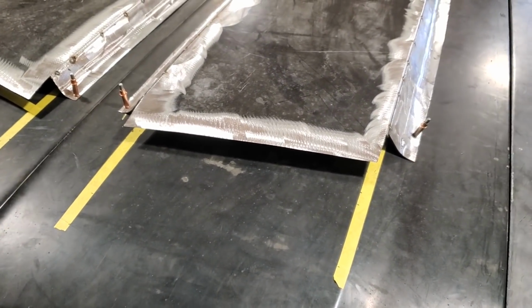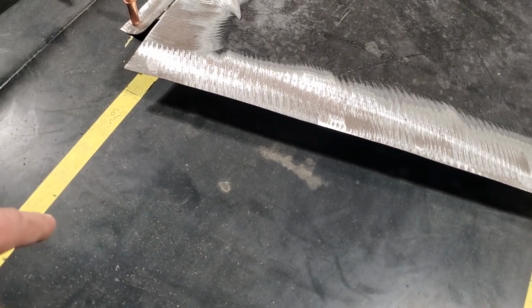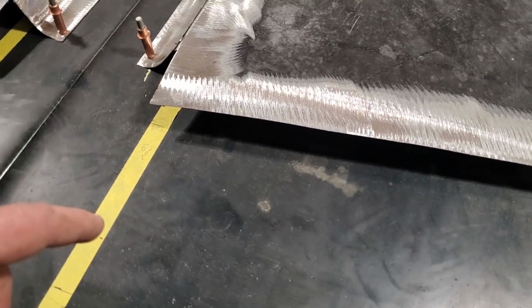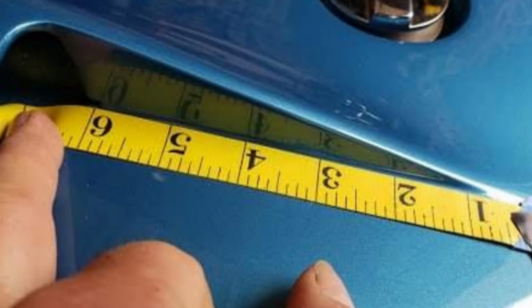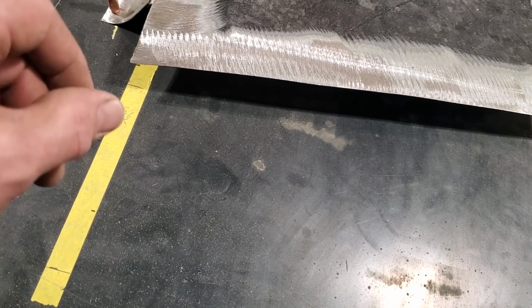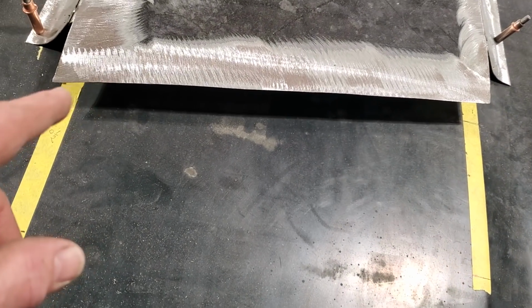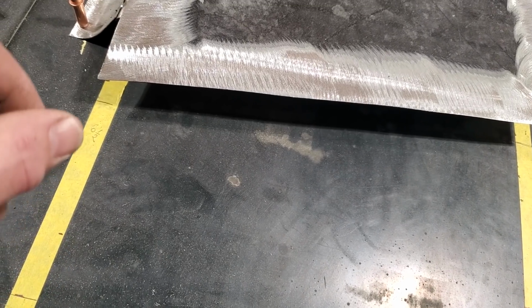That's going to be interesting. Okay, the first thing I had to do is figure out my two side pieces. Now, I have some pictures here. If you look in this picture, you can see that there's about a quarter of an inch wide lip that goes right to the front. So the front of the scoop is a quarter of an inch wide, then it curves out on the corners. The curve itself, from the end of the curve to the outside of the scoop, is about an inch or so long. So what I'm going to do is make two strips that will fit there.